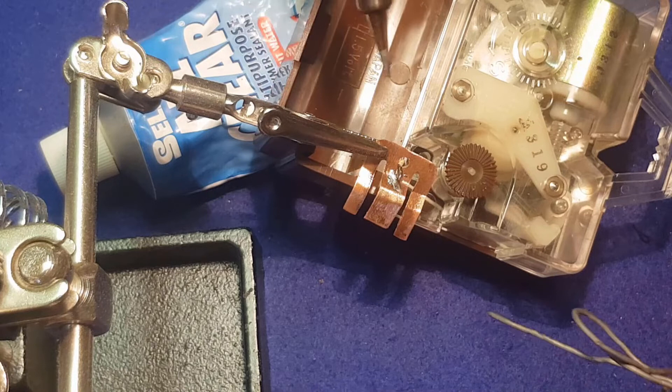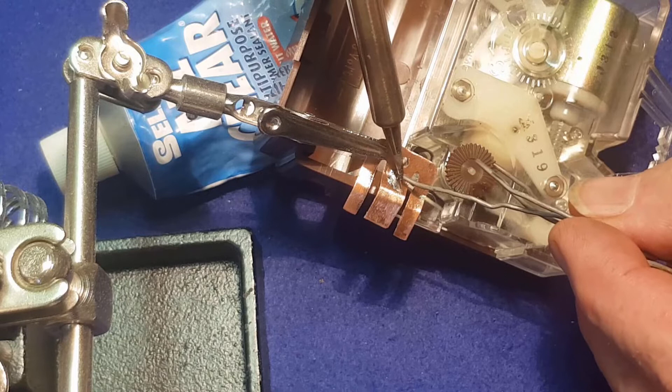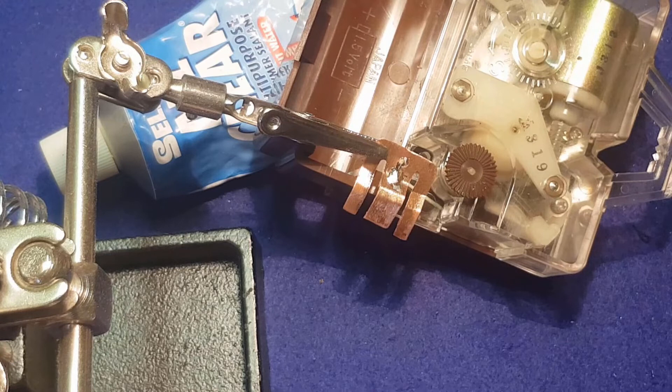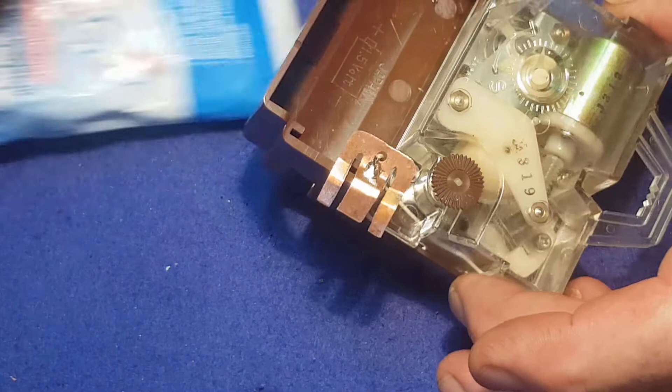I tinned onto the copper really nicely and I've got the wire through it now. I've got a little third-hand here holding it for me, so we should be able to just join the wire onto the solder. That will work fine - solder certainly sticks really well to nice clean copper. So we take that off there - we can move that frame out of the road and there we have it, our second battery clamp.